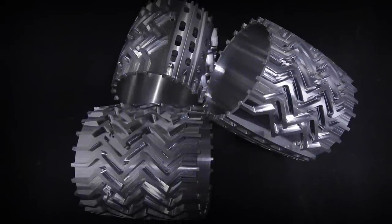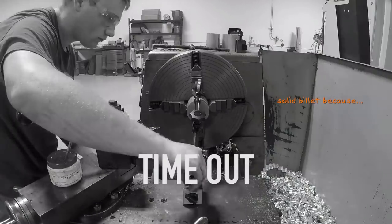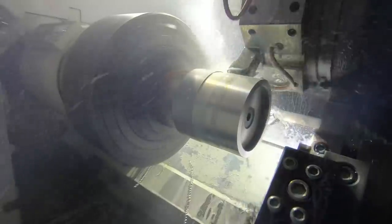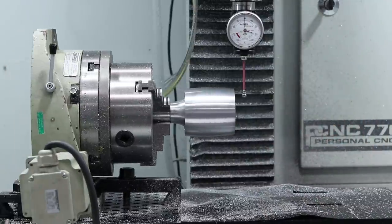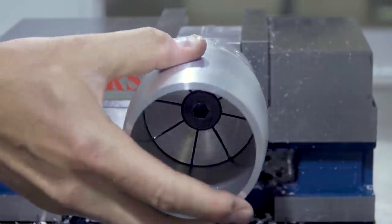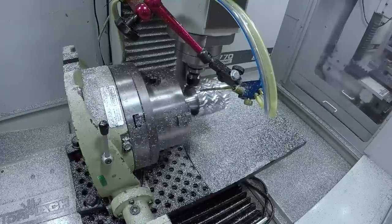Next up, we made these Mars Rover replica wheels for a museum — really cool parts. We turned the material on a lathe, and if you're wondering why we spent the time to drill this material out, the tubing cost was significantly higher than purchasing solid round stock. Then we needed to hold this relatively large piece of material for op 2 on the mill in the fourth axis. I wanted access to the full profile of the part, and the best way to do that is with an expanding mandrel. You can buy these for relatively small diameters, and if this is the kind of work you think you might do, absolutely pick up a set. In this instance it was a larger diameter so we made our own. It's a very secure, very repeatable, and very accurate way to hold this part, giving us full access to the profile of the wheel.